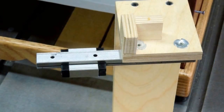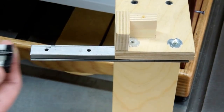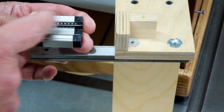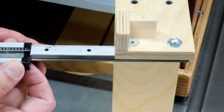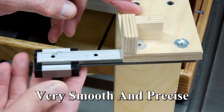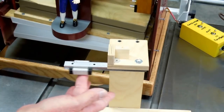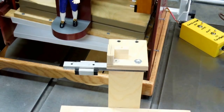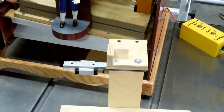This was listed on eBay as a CNC linear rail or linear slide. These sliders are trucks — they have a bunch of recirculating balls in them, and they engage and run on this V-slot. Very smooth. It's two rails and four trucks or sliders, and I got all six pieces for about $18.50. When I was looking for a way to mount the conductor and get it to move smoothly in and out of the organ, this is the way I decided to go. There are so many other ways you could do it — if the conductor is only going to slide a couple of inches like John Smith's, use a wood slide like what he did.